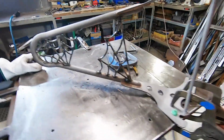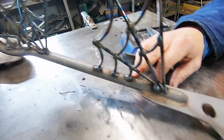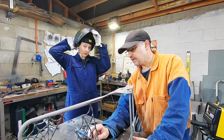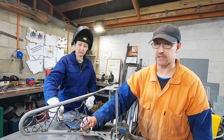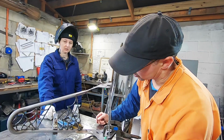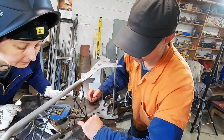One of the other reasons to fill the welds is where there's a gap round here, it's more likely to get a wee rust spot. Oh, true. It's a place where moisture can sit, isn't it? Yeah, and it's less likely in the bits that are facing downwards, where the water won't pool. It's where the water pools that is the worst. So if there was a gaping gap here or here, that bit in there is probably a vulnerable spot.